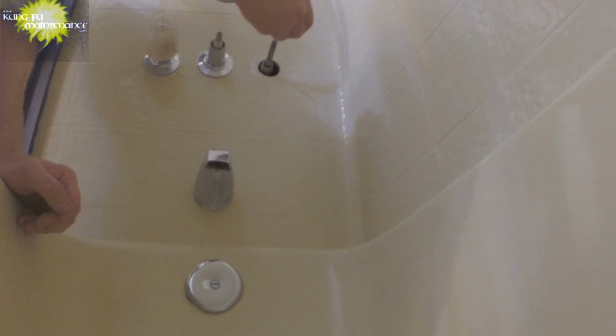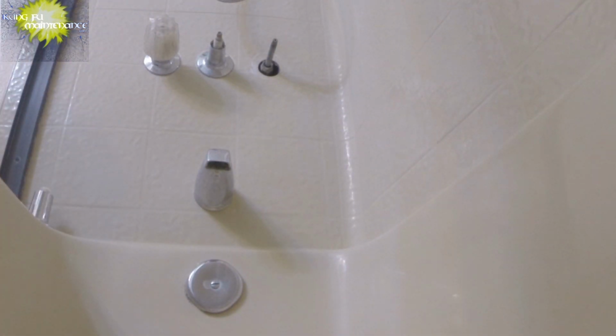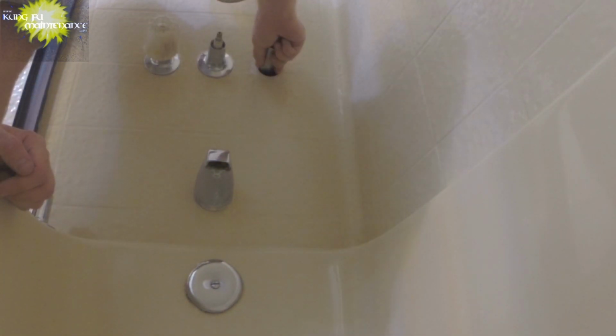So there's definitely a bit more you need to know on these. As you're turning the escutcheon off, that's the outer covering behind the handle, the metal portion, it's possible that it can pull the sleeve apart with the escutcheon. So you need to know that the sleeve gets turned in first into the valve seat portion, and then the escutcheon goes over that, and then the handle. It can really mess somebody up.